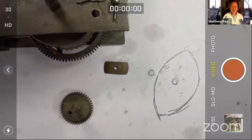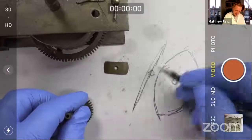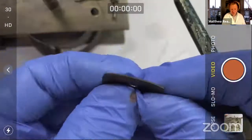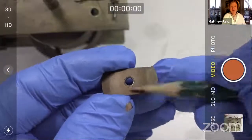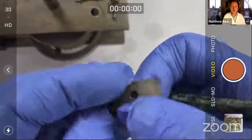Something like that. So it's tapered along its length, but importantly, it's also tapered in thickness as well. So it's compliant. What you normally get with a spring like this that's uniform in thickness and uniform in width is, of course, it only bends across here. So they tend to either buckle down and these parts touch on the frame, or they crack across the center.